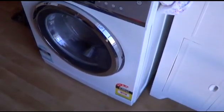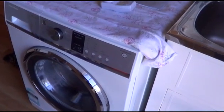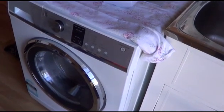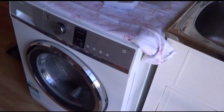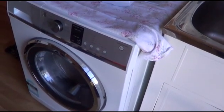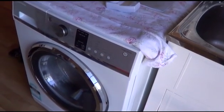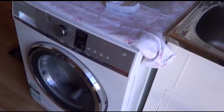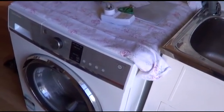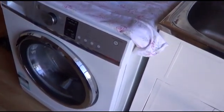I also run our washing machine off of that inverter outside. Brand new washing machine. I've found if you put the hot water on your controllers at 60 degrees, this thing will run off an 800-watt inverter. But if you let it internally heat the water, it jumps up from around 400 watts to about 2,100 watts with the heater on. On a normal wash I'm using around 300 watts total per wash, so that's pretty good. I run our washing machine off of there.